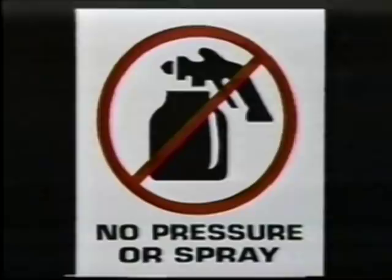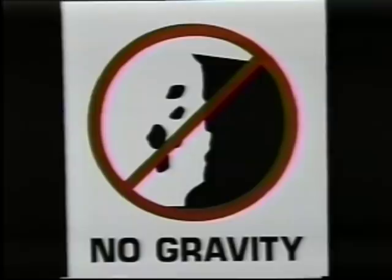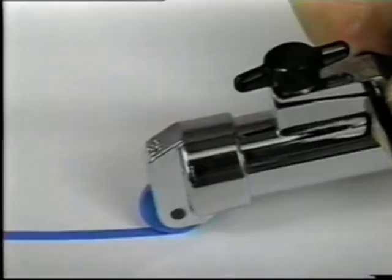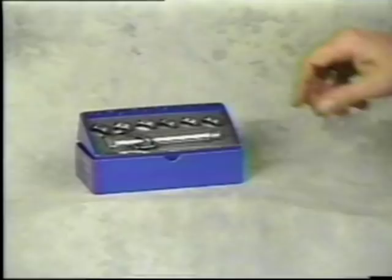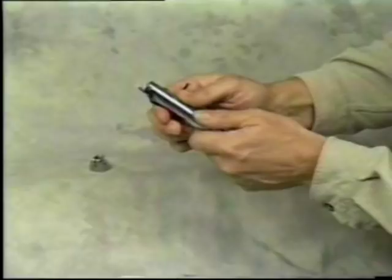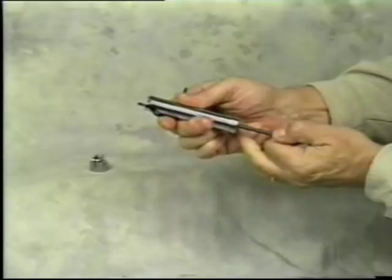The tool is remarkably simple to use with a unique wheel head design that distributes paint evenly on any surface. The Bugler tool is safe and non-pressurized. It is not gravity-fed, which enables paint to flow in any position, requires no tape for clean edges, and eliminates stick-on vinyl tape and brushes. The Bugler Striper's precision design and machining allows for an even layer of paint to be applied without variance in thickness or width. The Bugler Striping Tool consists of a paint barrel and friction-fit wheel head. When rotated, the wheel distributes paint evenly by way of precision serrations. The plunger provides a supply of paint without pressurizing the barrel.